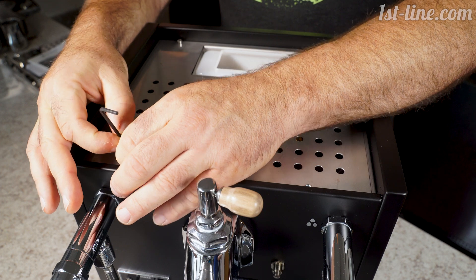There's an opening right down here — I'm not sure what that is — but this is a safety valve, and here's your bleeder valve. The purpose of the bleeder valve is that when you power down the machine it doesn't build a vacuum — it releases the vacuum pressure out. Machines that don't have this will not heat the steam boiler. This is usually the first place that limescale builds up and causes an issue, and if you have a lot of leakage coming out while it's fully warmed up and it's supposed to seal, then it's usually a problem right here.